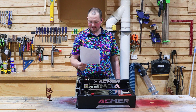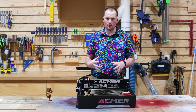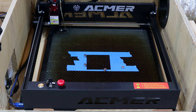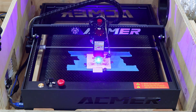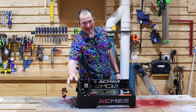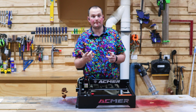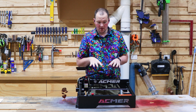I need to talk about a thick cut — thick cut ply. One of the things we need as makers is versatility. There's nothing worse than needing one laser for fine engraving and detail work, and a different laser to cut through thick ply. This one does both, just a little bit slower on the thicker ply. We've got a 6mm ply and we're going to give it a quick cut through — it gets through it, you just have to tweak your settings and speeds. Make sure you use an air assist for a much better finish. You can get air assist pumps, or just plug it into an air compressor with a valve to limit airflow — saves you having a second piece of equipment if you've already got a compressor. Handled it beautifully.